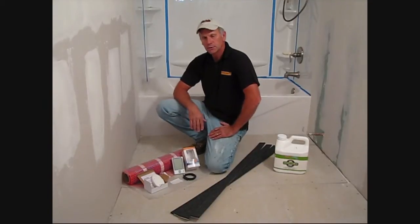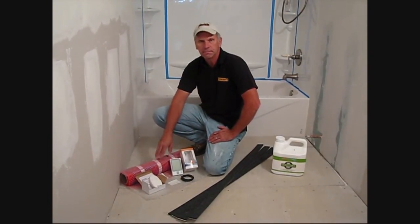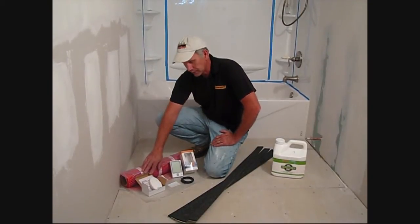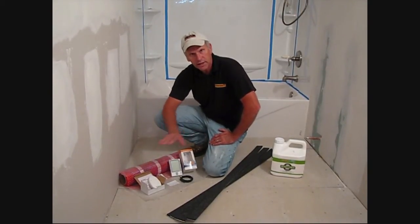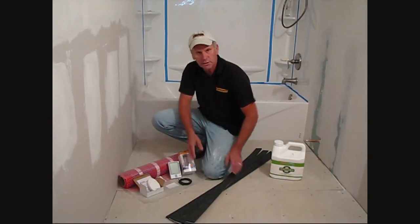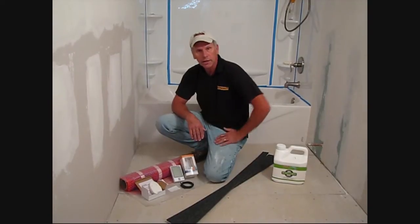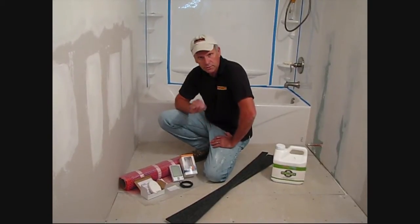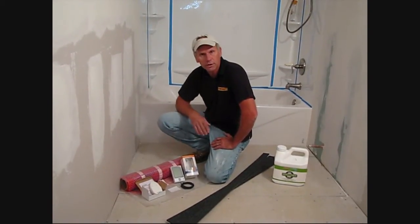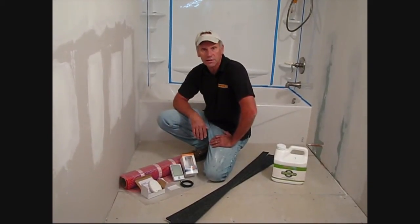Hi, my name's Phil. Today we've got an opportunity to be installing a Warm Zone electric floor heating system. We're going to be using a screamer — we'll explain what that is — that's in case you have any faults during the installation. We've got our thermostat and our floor sensor. We're also going to be using our extra kits and we'll explain how we do that with using a self-leveler. We'll be encapsulating the wire so there could be no damage possible to the floor heating system during the tile stage.